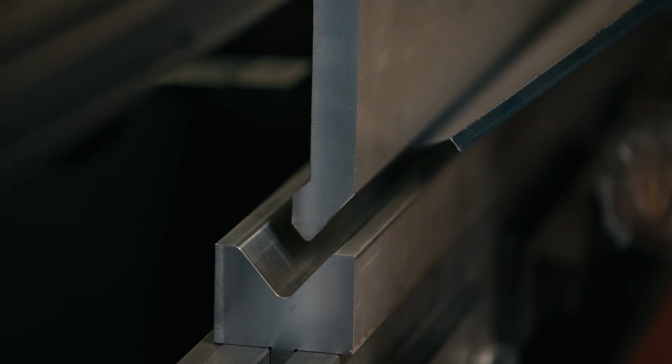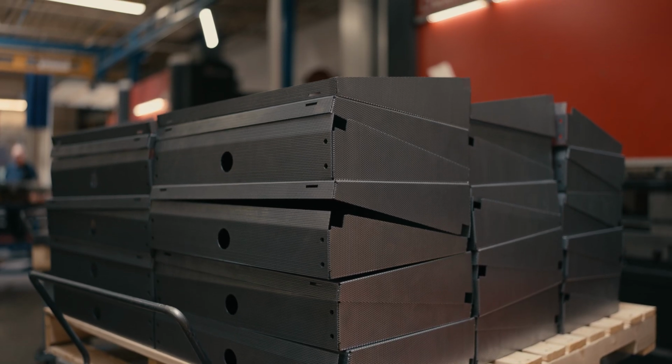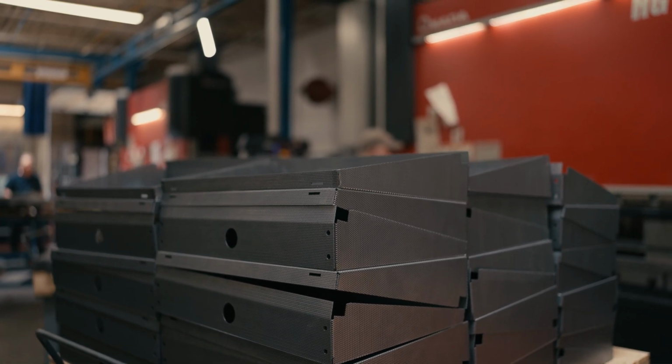The bend tolerance capable on the press is dependent on the bend that the customer is after and how the material is processed prior to getting to the forming department. For a production run, with the correct laser cut and grain direction accounted for, we can usually target a plus or minus 1 degree accuracy and plus or minus 30 thou leg or positional tolerance for the bend itself.